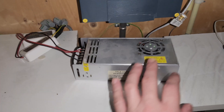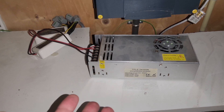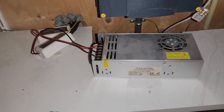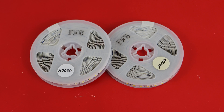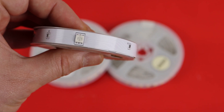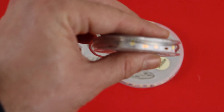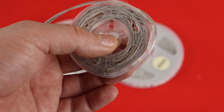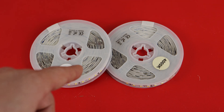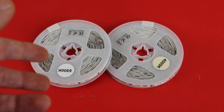I installed these LED strips in the living room, which works great, but I have to use a 24 volt LED driver which is quite big and you need to plan where to put it, because you cannot just install the LED strips and put it on the ceiling — it's too heavy. On regular LED strips, for example an RGB one, you have to have a power supply or LED driver, and even the simplest forms do not work on AC — you need some sort of driving circuitry. I found these AC strips interesting because they eliminate the need for a power supply or LED driver and you can just plug them directly into the AC circuit.